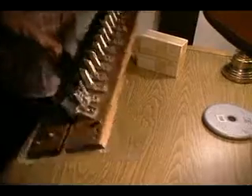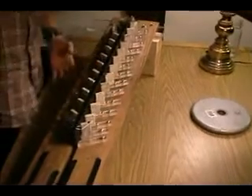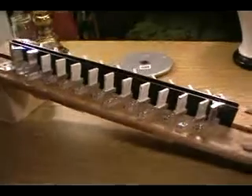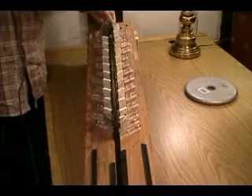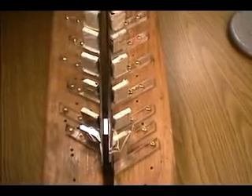I'm going to pick it up and turn it around to show that it's a freestanding piece of hardware, not tied into anything. Turning it this way and pulling the shuttle magnet out again. In this configuration we have the wings facing the other direction, pointing downhill, looking like the feathers on an arrow. We're going to take the shuttle magnet and drop it down to see if it goes any farther with a gravity assist — only about 10 to 15 degrees of incline. It goes all the way to the end and stalls again between the last two pairs of magnets.